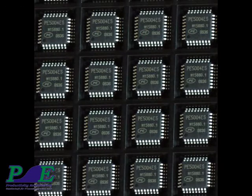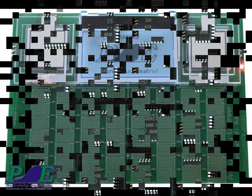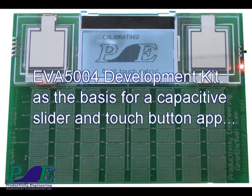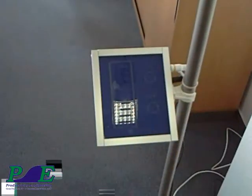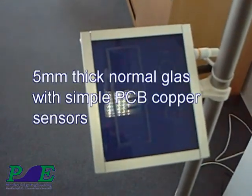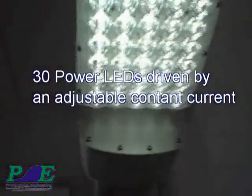This application presents the PE5004 capacitive touch sensing integrated circuit in an application with a high-power LED lamp for dimming. The LED lamp employs the PE4202 power factor correction IC. The LED lamp dimming is conducted by controlling the secondary voltage with a simple R2R resistor string DAC. The DAC is directly driven by an 8-bit output of any simple microcontroller being connected to the capacitive touch sensor circuit.